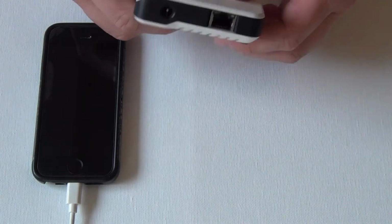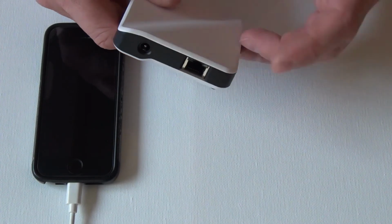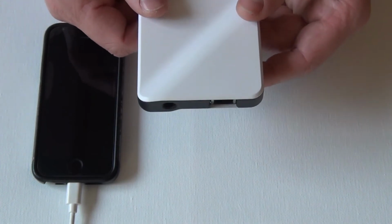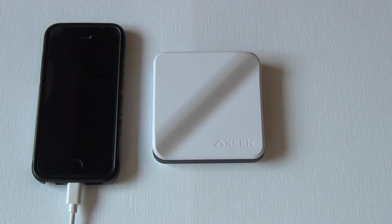Okay, but the hub has to be plugged into the Ethernet port. The repeaters do not. The repeaters just need power. You would put these repeaters between the hub and your farthest vent. Now, if they get out of range, your sensors will not update. The vents won't open and close. The lights will start flashing on the vents, and you'll know that basically they're out of range because they're not working. Then you basically have to get a repeater.